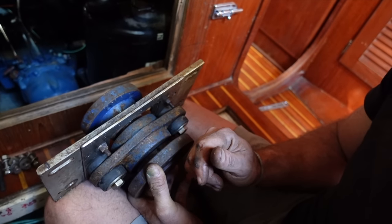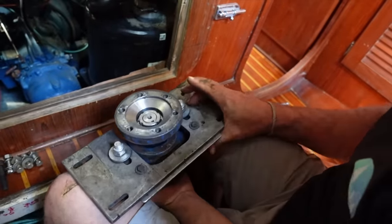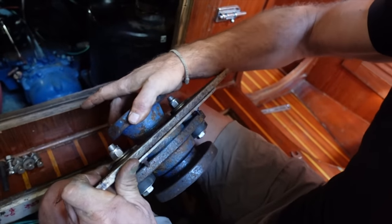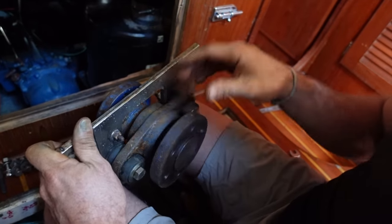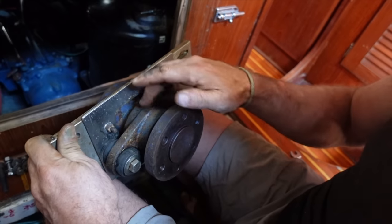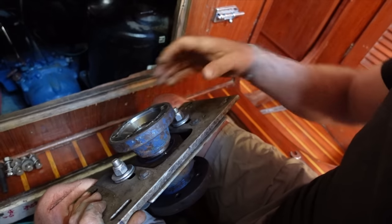That's what we're working with and I'm going to see if the bearing — I had a suspicion because I had a whistling sound. There's a lot of play there, which tells me the bearing is shot. So I know these are about $600 to replace, but I'm just going to clean this up with a wire brush, repaint that, and really all it is is the bearing.